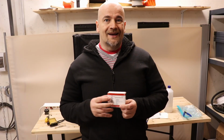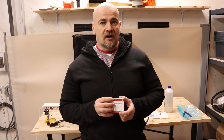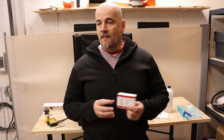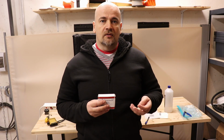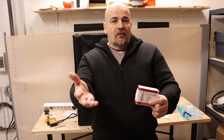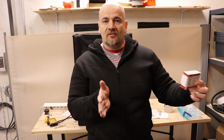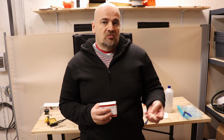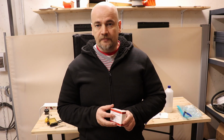If you need more, then definitely you have to upgrade the firmware, and unfortunately there are no prepared firmwares, because if it's prepared you just copy it to the SD card and insert it in the printer and it will be updated. I was communicating with the guys from Micro Swiss, and they told me that they will prepare these bin files for the most popular 3D printers. Depends on when you watch this video. If you are watching 1 year after I did it, then maybe it doesn't make sense to edit the firmware, because probably you will get the prepared binary file on the Micro Swiss website or somewhere similar.